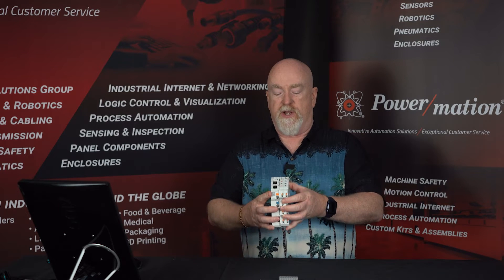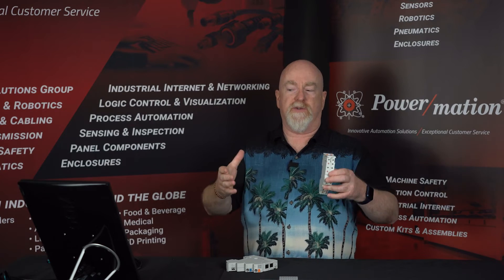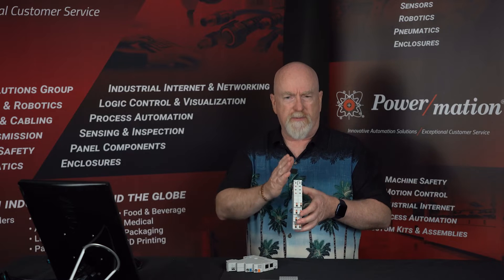The electronic breaker modules simply slide into place alongside any Caprock module. There are grooves on the side, and once in the rail you slide them together and keep adding modules. Modules are available in a fixed current variety of 1, 2, 4, 6, or 8 amp ratings. The adjustable versions I'm showing today come in single channel, two-channel, and four-channel versions. The two-channel version has rotary switches and an indicator light push button, while the four-channel version has indicator lights that also function as push buttons.